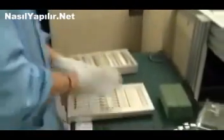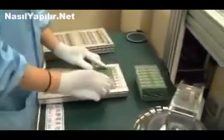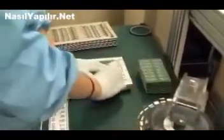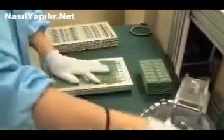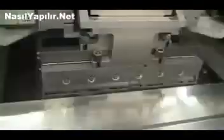You guys ever wonder how a USB stick got built? Over here we can just see the first step of all. This is the raw USB stick, or the fundamental one, coming over here and they're putting it into a magazine that you saw before. And then we need to head over here. They're getting into the first machine, which is called the solder paste printer, which you can see on this little fella over here.